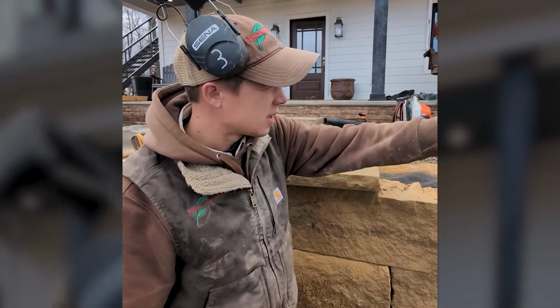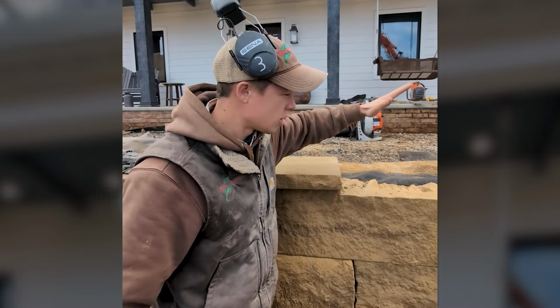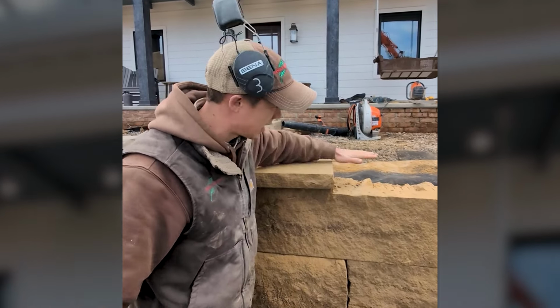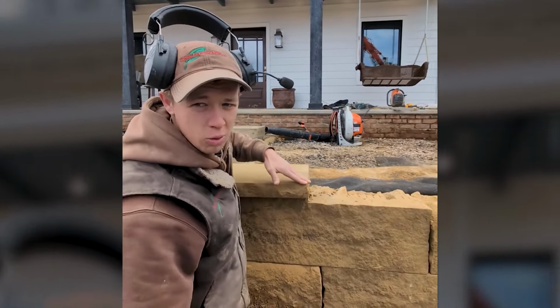I have a big 6-inch drop that goes back and ties that plate into the base to keep it stable. So she sets right on here and base goes over top of the thing, pavers lay over top of it. And when you're done, you get a rock solid aluminum plate where you can get a nice overhang over the edge of the pool. Pretty cool.